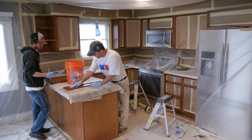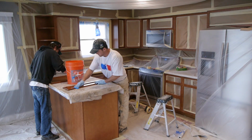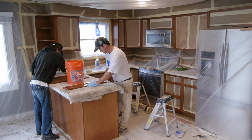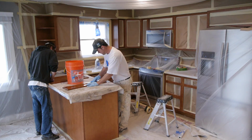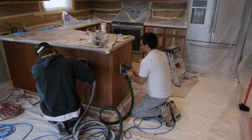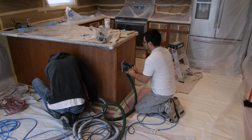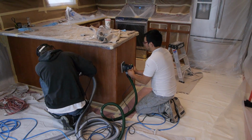After the doors have been removed, you will want to clean everything thoroughly with a deglosser/degreaser. We use M1 from Sherwin-Williams and we find it's a really good product. Now you'll want to scuff sand the surfaces with 220 grit sandpaper. You don't have to spend a lot of time on the scuff sand, you're just trying to create a dull, dry surface before primer is applied.